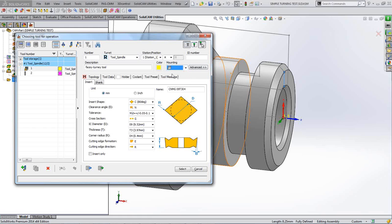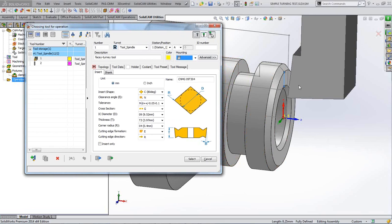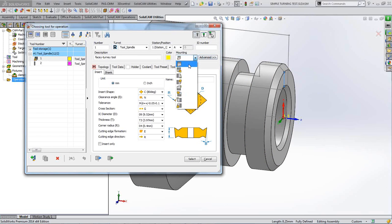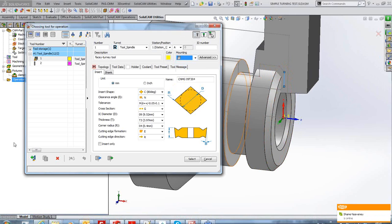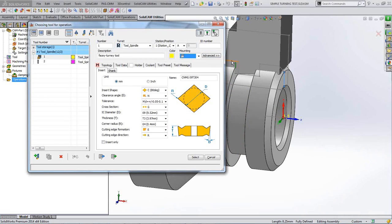What I want to do is have a turning tool there, a tool that's capable of both turning and facing this part, so I don't have to use two separate tools. If I chose, let me see, where am I? This tool here, that would probably also do the job, but me being me, I like it the traditional standard turning way. Alright, I can't see the tip, it's a backwards facing tool, but it matters not. That's the orientation of the tool for the image of this part. You could have a left-handed tool where you've got the tip facing you, but for this part, this is what the image is going to be.